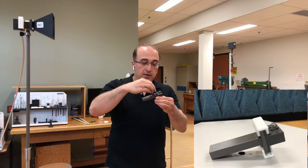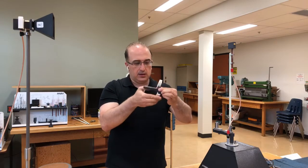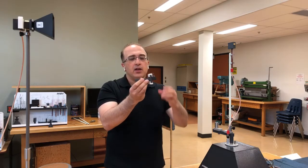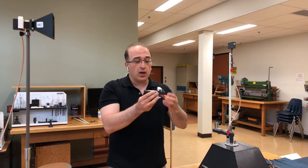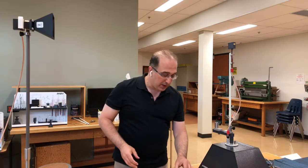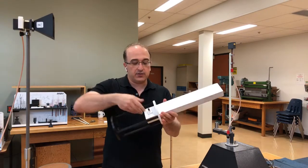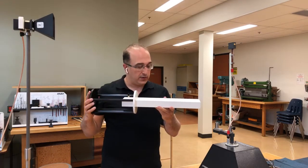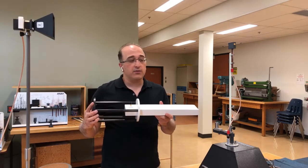To connect the two waveguide pieces I'm going to use the same quick-lock method we used for the horn — one pin here and one on the opposite side. That's essentially our antenna under test, an open-ended waveguide antenna. One thing to note is that open-ended waveguide antennas come in different sizes for different frequency ranges — a larger one operates at a lower frequency range compared to the one we are testing today.